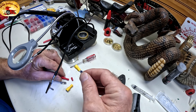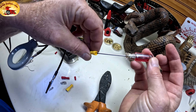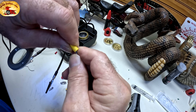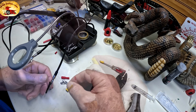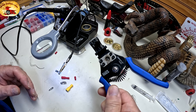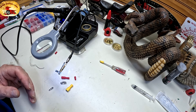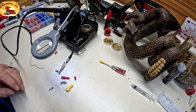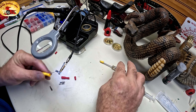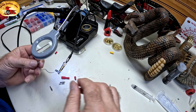So here's what you do: you take your crimp terminals right here — you usually just have to push the metal part out with a screwdriver like this and they'll come right out. We're going to clamp that in the jaws here. These are the strippers that we use, and these are the crimpers that we use — they work great. We're going to go with the flat one for now; the bullet type we'll do later.